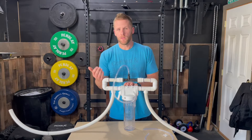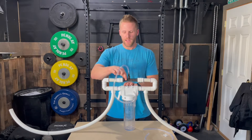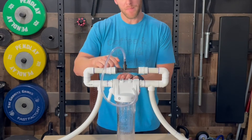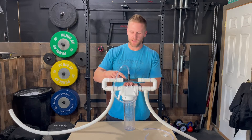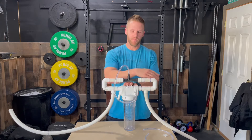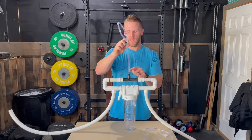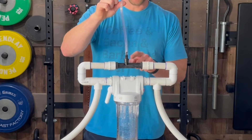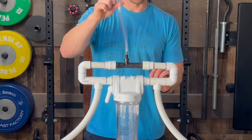At this point it branches off — some of the water goes through the filter, some of it goes up to get sanitized by the ozone. On the opposite side the water meets back up and flows back into the tub on the outlet side of the filtration system. The way that the ozone works is as the water flows up through here, this venturi condenses down so the hole size inside the pipe gets smaller. In doing that, water pressure increases through that hole and shoots faster through that venturi unit. That essentially creates a vacuum through this tube which pulls the ozone down into the water.